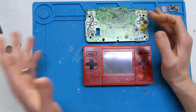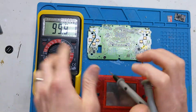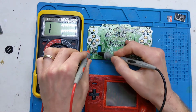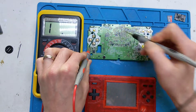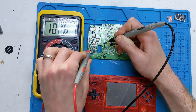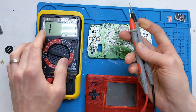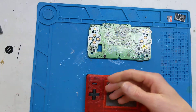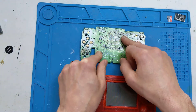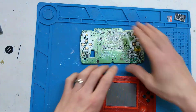So I started tracing around the board. I found the test points but I'll show you on my multimeter what I actually found. I had the meter in continuity mode and was literally probing all over the board. I found this point over here which gave us just over 100 ohms. Now, I remembered if it were a direct connection it would read zero, so I thought — right, test it out. I found that point, and there's one for the top screen as well, both giving about a 100-ohm reading. So I tapped off those points into the switch.